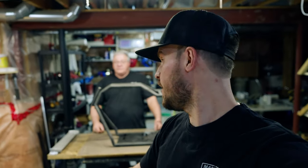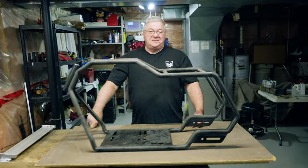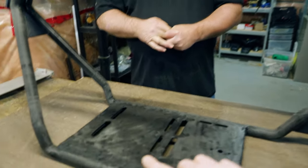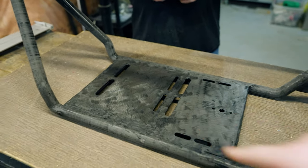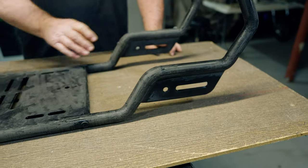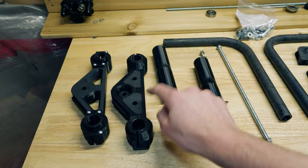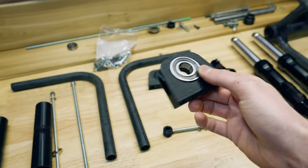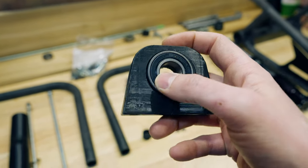So we just spent the last whole week assembling the entire MBK-1 frame. It looks good. What I really like are the engine slots going horizontally rather than vertically, because now you can actually put any motor you want and easily shift them over. And no more worrying about the motor — you put it in one spot and use the back to tighten up the chain as tight as you want. We've got the front end with the upper and lower clamp, the nice handlebar riser plates, the handlebar sleeves, the handlebars themselves, the jack shaft, and a set screw that holds the bearing in place.